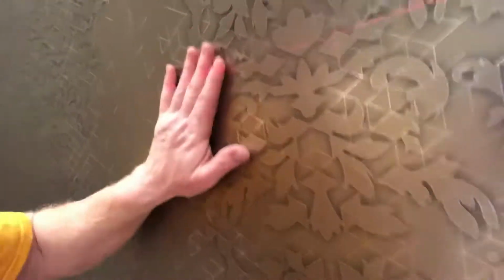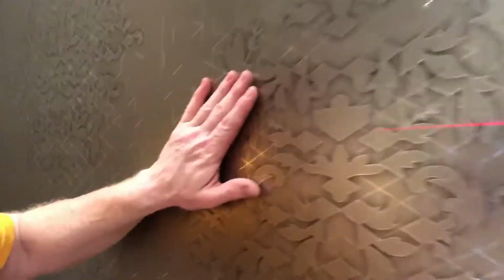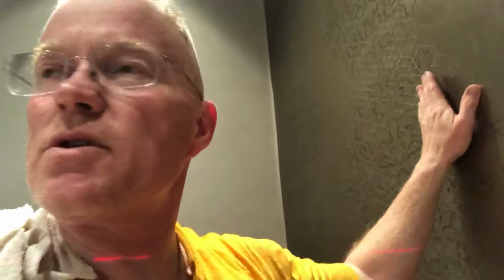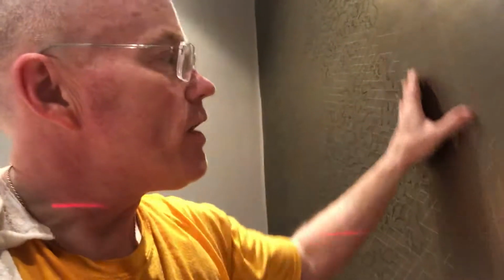See this right here where you can see this point? Watch this. See it now? Constantly working the seam, okay? Until you call it. At a certain point after you install it, you'll see that it doesn't move anymore, and then you're done. Okay, so this is normal, but you keep coming back to your seams and you're stretching it back. It's pulling back and you stretch it back. And as you keep looking at your seam, if you want to make the job perfect, you're going to keep coming back to it.